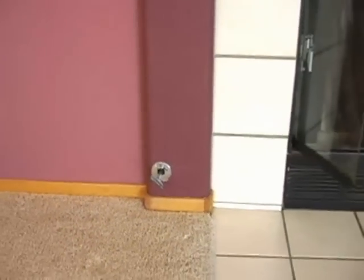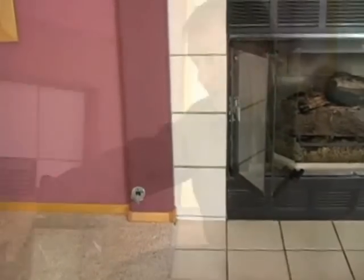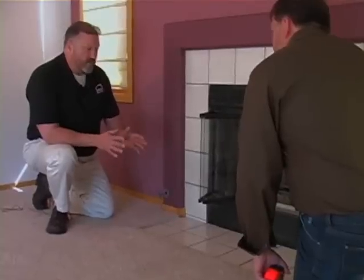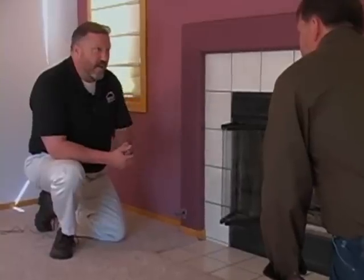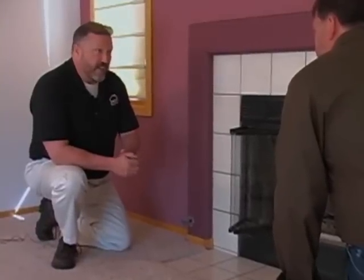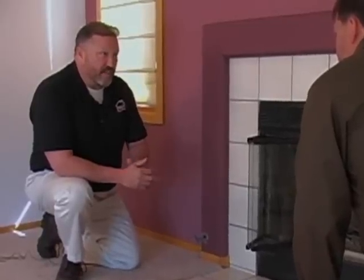So there's no way around the 16-inch hearth rule? What about with glass doors, chains, or a fire-resistant hearth carpet? There's no way around that. You have to have a non-flammable surface, a safe distance out from anything that can cause embers to drop out. That even includes pellet stoves and the like — you have to have protection because we know homes have burned down because of this.